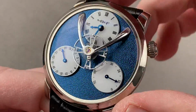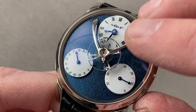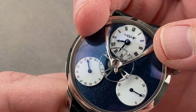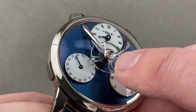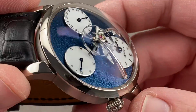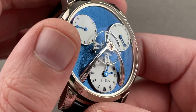The balance is 14 millimeters in diameter with recessed bolts and free sprung for durability and precise adjustment. It has a full dual-anchored balance bridge for shock resistance and better bracing against shock. And then you can see that it beats at 18,000 vibrations per hour, and it features an overcoil hairspring. Because the overcoil has a more centered mass than a flat hairspring, in any position with respect to gravity, on your wrist or your dresser at night, it's going to beat concentrically, so the watch keeps time very evenly in spite of position.